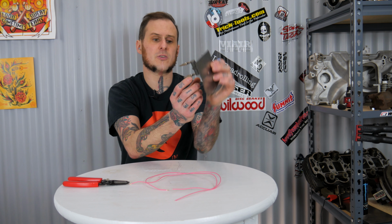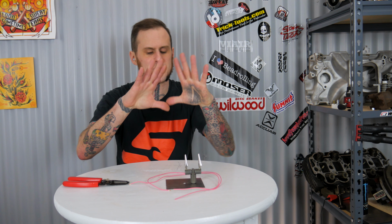If you're up underneath the dash trying to do a quick soldering job, well, you can go ahead and stick this to the underside of there, hold the wires together, ready to go, and it'll keep them together when you're soldering. Nothing's worse than when you're mid-solder joint, you're getting that solder in there, and the wire pulls apart. Now you gotta set it all back up. You've got solder in your wire now, so it's not gonna splice together nicely. It's a real pain. This is a much better setup for doing these simple operations.